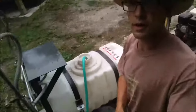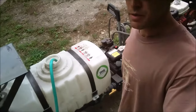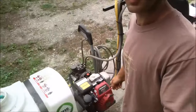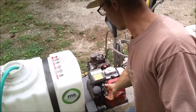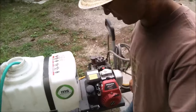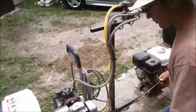I'm putting straight hot water in the tank to get it good and hot to dissolve the neem. You want to keep it warm. You've got to work quite quickly once the neem is in the tank. We're going to start up the sprayer because we also want it agitating — as soon as the neem is in there you've got to have it agitating or you're going to plug stuff up. Pretty much all this stuff — fish and everything — is just going to plug everything up.